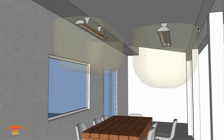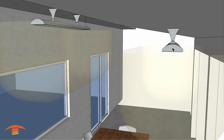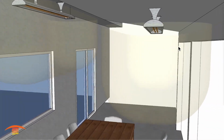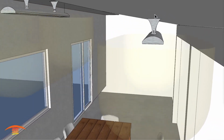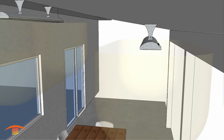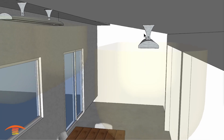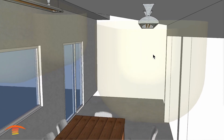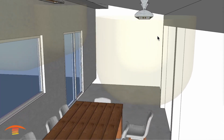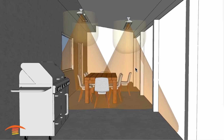And you can see over here, 18 inches from this edge. And why did I do that? Because I want to make sure that the heaters are flat. Once I take this heater and change the angle of the heater itself, then I need to maintain 12 inches of clearance above the heater. And if I maintain that, then the heater is going to drop down an additional 6 inches from where it's at, and the intensity is going to be a lot more than you would hope for.